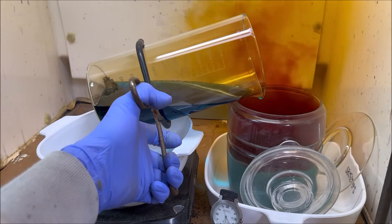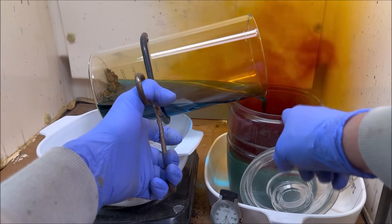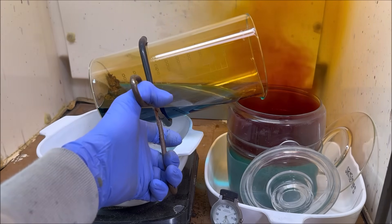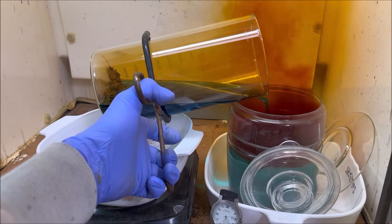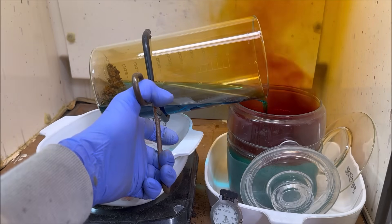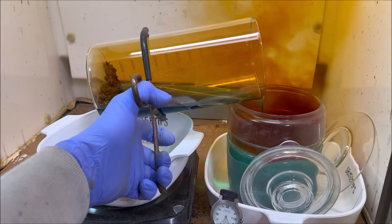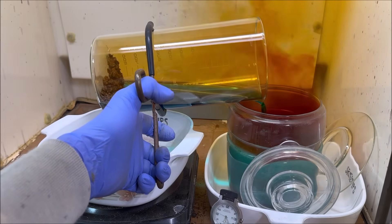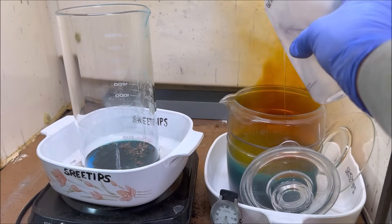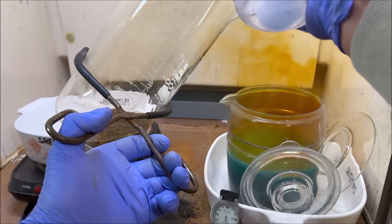This is where the silver comes from for my electrolytic silver cell. I use sterling silver to refine gold, then pour it off into my silver jar after extracting it with nitric acid boils. You can see there's still a ton of active nitric acid left in that solution — it's reacting vigorously with the pieces of sterling silver I added to the silver jar. I keep a bottle of distilled water handy to knock the reaction down just in case it tries to boil over the rim of the silver jar.